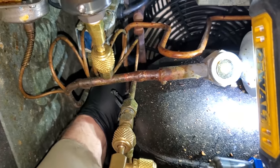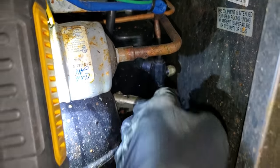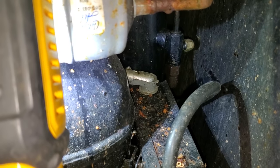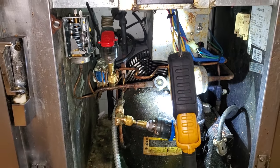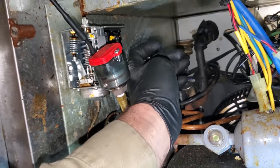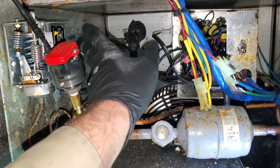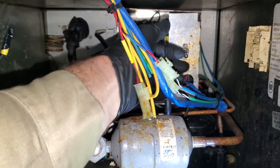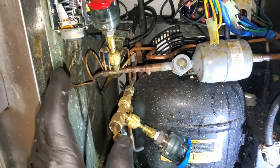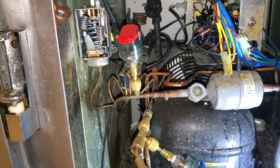I pulled the insulation jacket off the expansion valve. Using your senses: I don't feel any remnants of oil, and the TXV itself doesn't look too bad, so I'm not sure the leak is there. Typically you'd find an oil problem somewhere — I do see some remnants of oil on the king valve on the receiver. At this point we're going to need to pressurize the system and do an electronic leak search. I pulled one lead off the low pressure control and taped it up so I can energize the unit safely without the compressor turning on. We're going to put a tracer of R404A in and bump it up with nitrogen to find the leak.